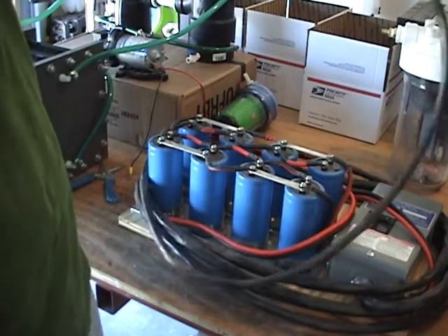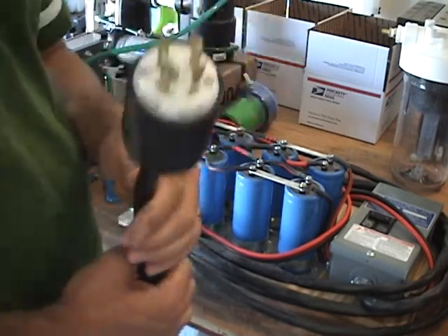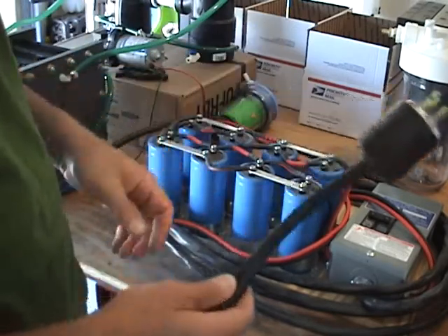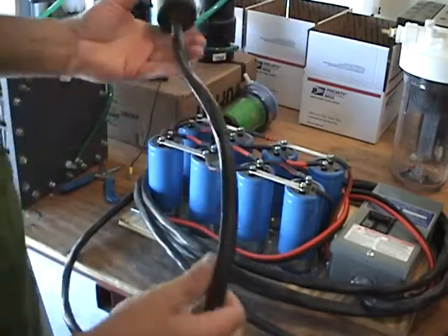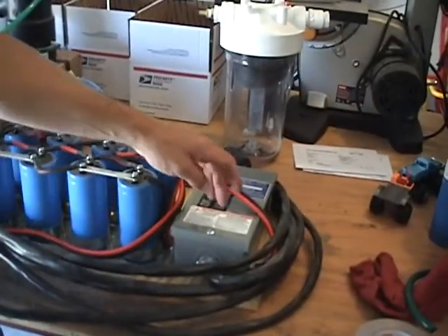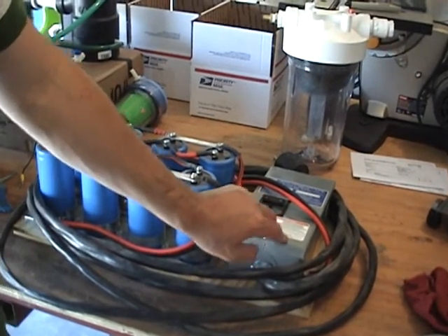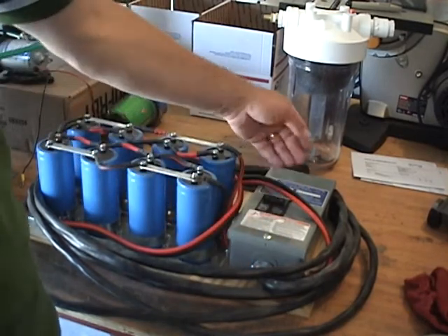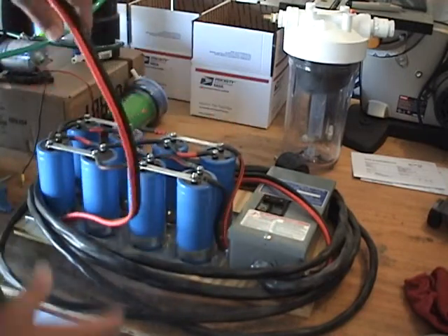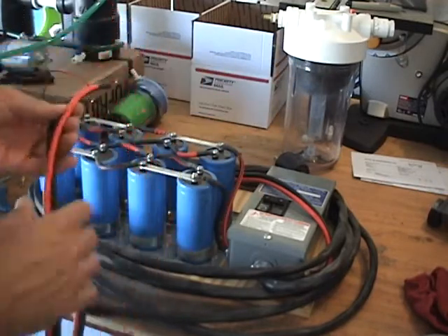On one end I've got a 30-amp, 240-volt twist-lock plug. I think I used 8-gauge wire going into the gas generator. They're going to come in through this box and go through the bridge rectifiers, which change the AC voltage into DC voltage. There's a 30-amp breaker — basically this is my on/off switch. From there they'll come out of the rectifiers out of the box with positive and negative DC, right into the hydroxy generator.